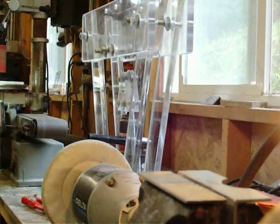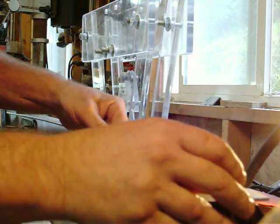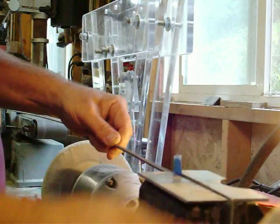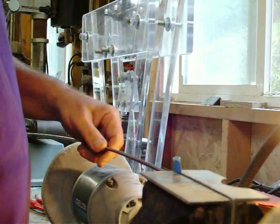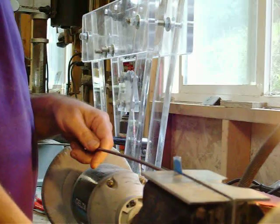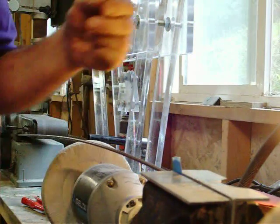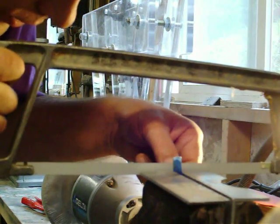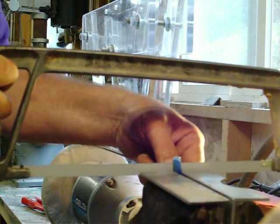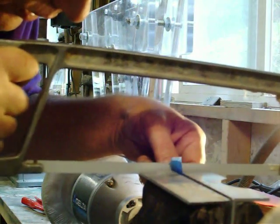Now we're over here at the bench vise. What I do is I take the rod, the part that I want, and I clamp that up and just let the other part hang. I like to have it kind of in plane to the earth and in plane to the floor, just to give me some sense that I'm cutting straight up and down. There's my little flag sticking up. I hunker down on it and get my blade until it just touches the tape, and then I pinch my thumb on the other side. It keeps the blade from moving, and I make small cuts until I can get a little channel started.